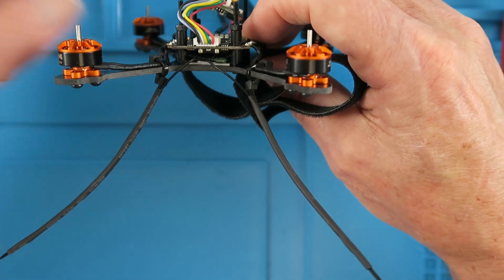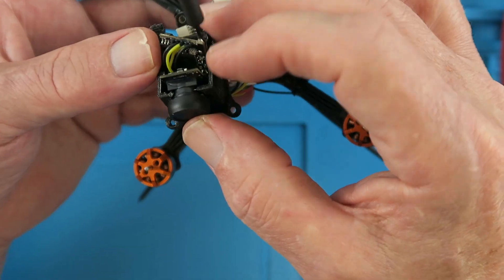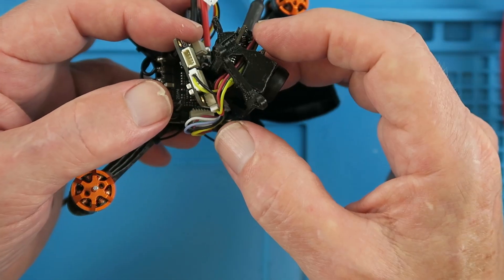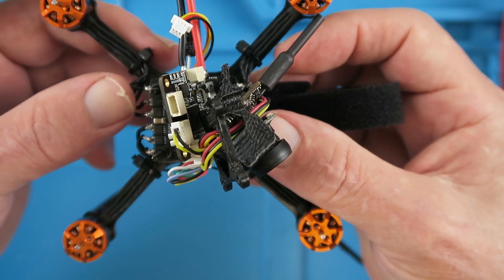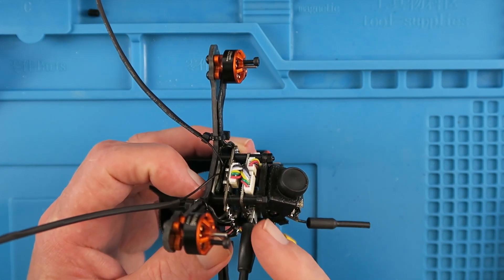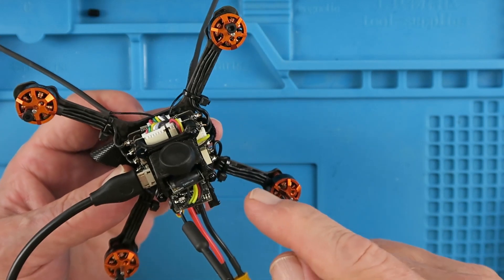If anybody's got any better solutions then please leave a comment below. All that needs to be done now is to fit the flight controller itself and then the camera board on top. The camera board is a bit of a tricky layout as the VTX wires are on the same side of the circuit board as the antenna, so that has to face up, which means stretching the wires down and out of the base of the unit to plug into their respective connections. When doing up the screws, remember not to over-tighten them — the spacers are only rubber and you can compress them down. Leave them at full length and use a dab of Loctite or thread locker to stop them vibrating loose.